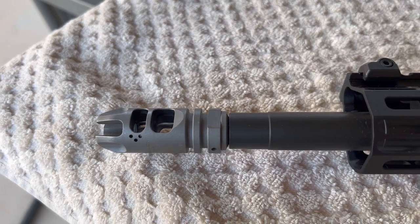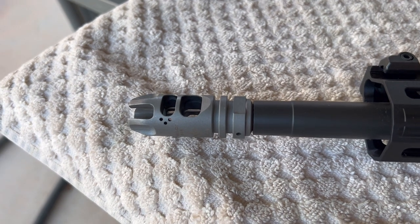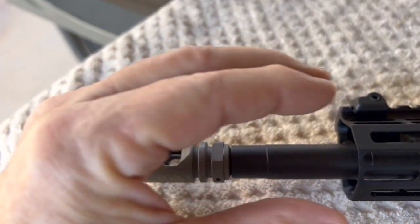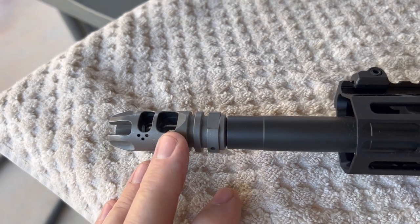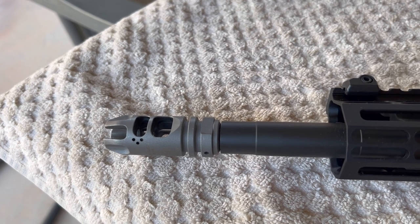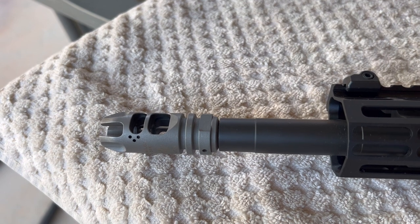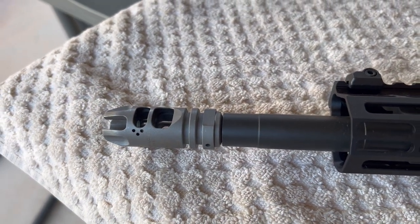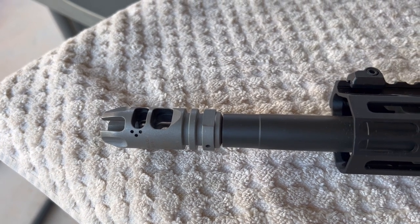I'm going to give a shout-out to a guy that runs a channel called AR-15 Tech Tips in Under Five Minutes. He did a very good video showing what happens at different torque values between this muzzle device and the barrel. As you tighten this to the barrel it wants to pull, and when it pulls you are affecting the inside diameter of the barrel. This is very important if you're using a muzzle device that needs to be timed — using a crush washer, peel washer, or some type of shim kit. In his video, starting around 12 to 15 foot-pounds, he demonstrated using an erosion gauge in the barrel as he was tightening, showing the dimension inside the barrel changed.